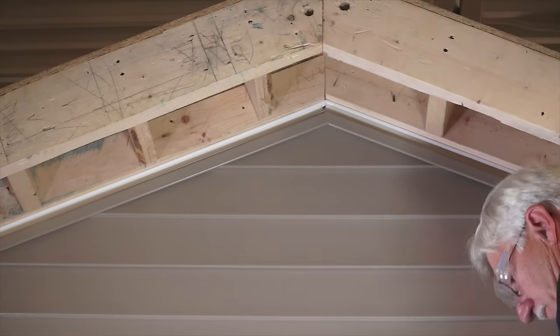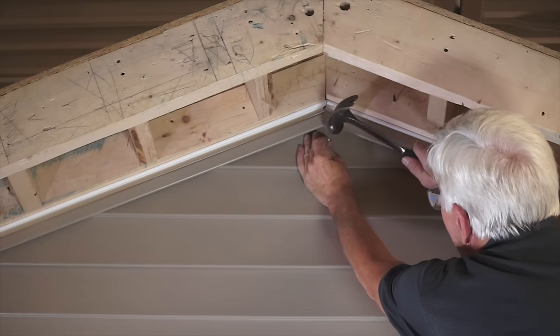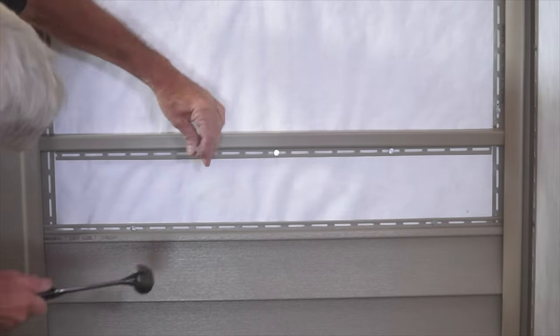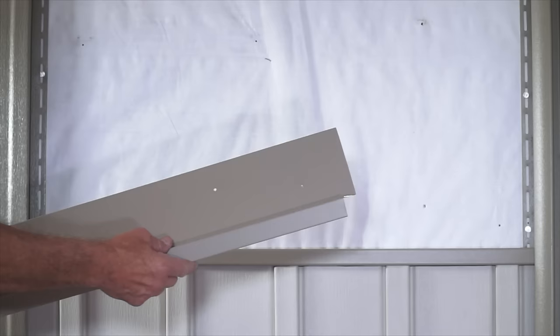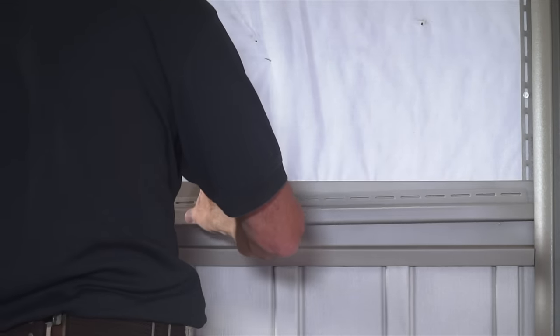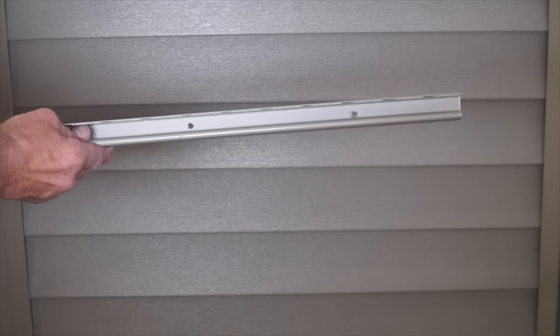The last piece in the gable must be face nailed with a long color matched trim nail. Except for this instance, you should not be face nailing. To transition from horizontal to vertical siding, finish the last course of horizontal siding with J-channel and finish trim, or double utility trim, and then install rigid head flashing and a J-channel, leaving a small space between the trim and J-channel. The top piece of J-channel must have a minimum of 3/16 of an inch diameter weep holes drilled no more than 24 inches apart to allow for water runoff.